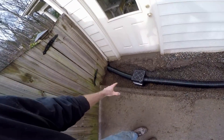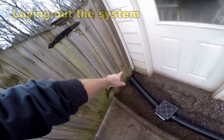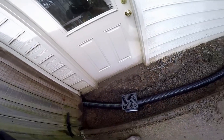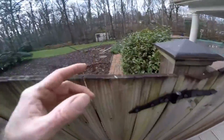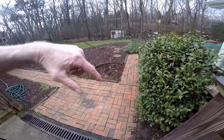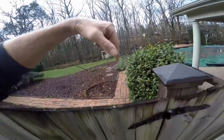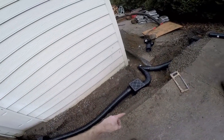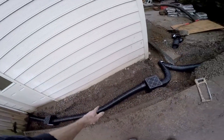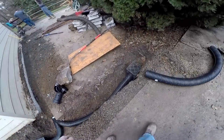So we've laid this out so you can see how this is going to look. Remember, this is perforated pipe, and it's coming over here to the downspout — we'll hook the downspout up, catch basin here. We're picking up all the water coming off this driveway. We couldn't go the other way because of all the brickwork — there's also fiber optics buried where we would discharge, and it's a lot further to go all the way down to the creek. So we had to dig through grade. Remember, when you're planning your project, water has to run downhill. We've dug through grade and we're going deeper down through our trench. You can see the catch basins and how the system sets up.